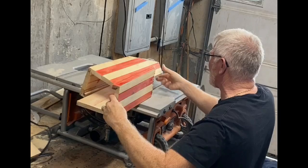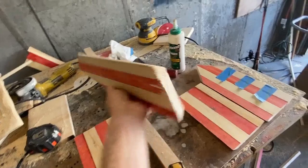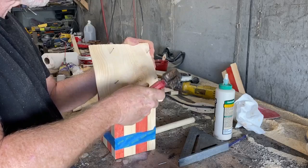This is really showing you how to make a patriotic themed birdhouse — the size doesn't matter, whatever size you want. You're going to end up with a front and a back that have angles cut for the roof, and two sides that are basically rectangular. All of those pieces will have the 45s cut on both sides, and they get assembled the same way I showed earlier with some wood glue and some tape.